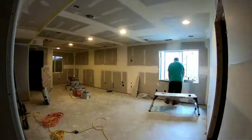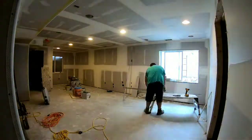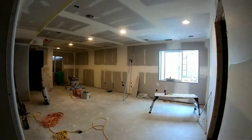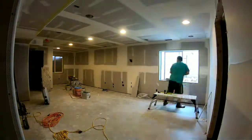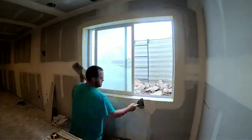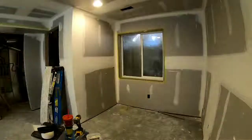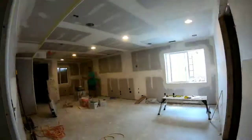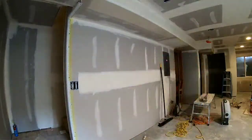Here I'm doing the window sill of the windows, then installing my square bead — pretty common for windows. All bead: make sure you mesh tape it. Don't use paper tape and don't skip taping it entirely. Taping helps spread the crack joint so it doesn't crack. It's cheap, it doesn't take too long — just do it. Bead generally needs two to three coats; this is the first coat.